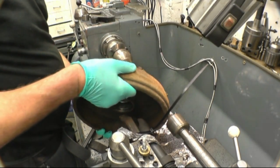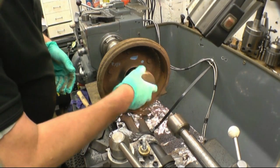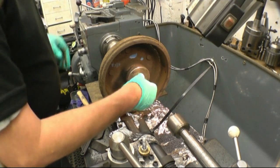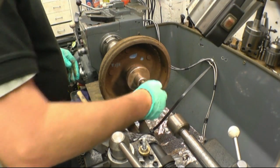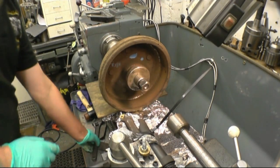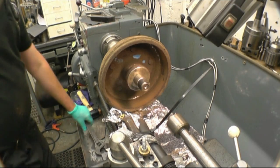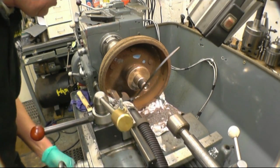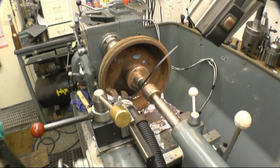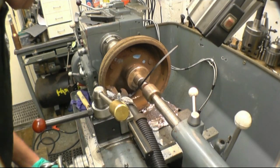I did say I wasn't going to machine any more brake drums, but these ones are nowhere near as rotten as the last ones — not nearly as much rust on them. I found that by using tinfoil I can protect the lathe quite nicely. I'm mounting between centers — between two tapers, the same as I did last time — and it's running nice and true; easy, quick, fast setup. Basically that one just needs machining in one cut, so it's not too bad at all.